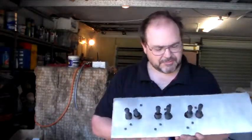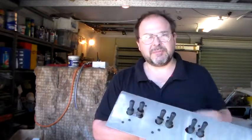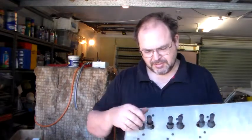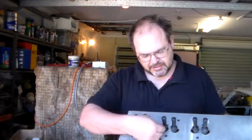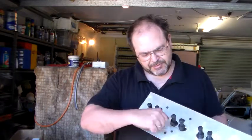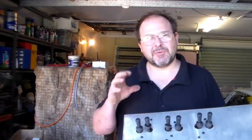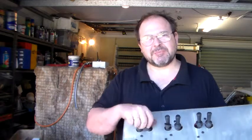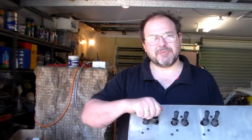I got my extra levers in the mail the other day, so I thought I'd put those in. Bit of a rough job, but it's all about function over form, I guess. So they come in pairs for each of the three pneumatic cylinders. As discussed before, each lever will only control one direction, either up or down. So I had to pair them to give me up or down, and I'm making a bar clamp to clamp the two levers together so they move the same.